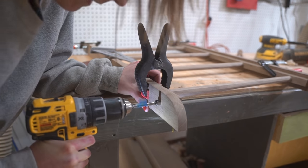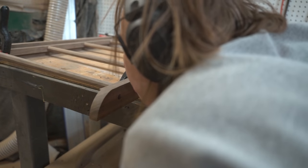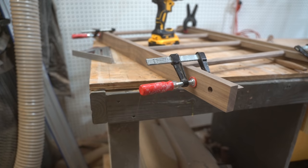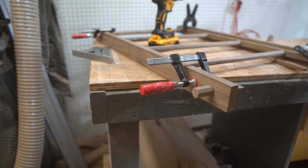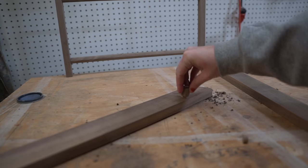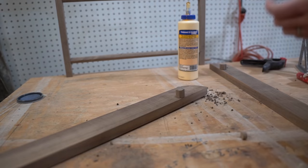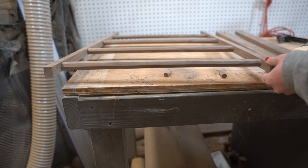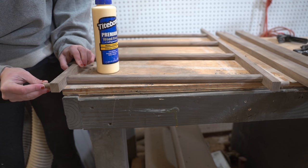After that, I drilled the mortises for the pair of detailed pegs responsible for holding the rack when not in use, all the way through the outer frame and a quarter inch through the interior rack. The final two detail pegs were glued as secondary reinforcement for the lower rack to rest against when fully extended, and the last two dowels were glued into place and trimmed to sit flush to the outer frame face.